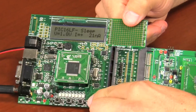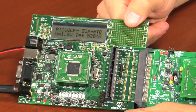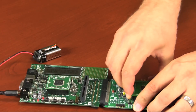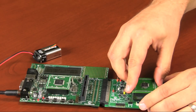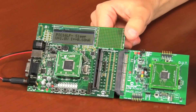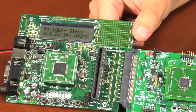By pressing this button, we add in the real time clock current. Now you can see that the PIC is consuming 800 nanoamps. Next, for the watchdog timer, we'll switch out the plug-in module with one that has been programmed for sleep plus watchdog timer. Again we press the sleep button and now we can see that sleep with the watchdog timer enabled is now drawing about 500 nanoamps.